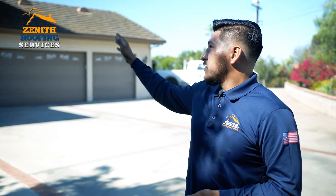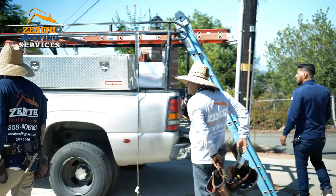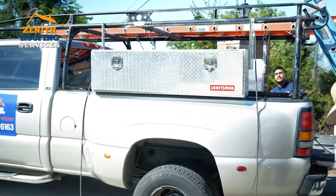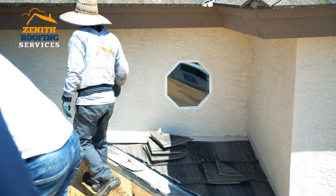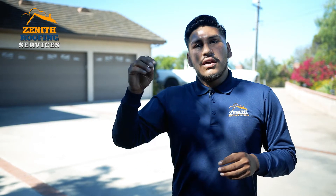If you have just tile on your roof with no underlayment, your roof would leak in several places. If you have a roof with no tile and just underlayment and flashings, your roof wouldn't leak if it were to rain. The underlayment doesn't last too long under the sun — it lasts about six months — so you do want to cover it up. If you are doing any track homes or new construction, you want to make sure the roof is done within that six-month period because that shortens the lifespan of your roof.